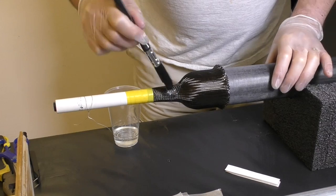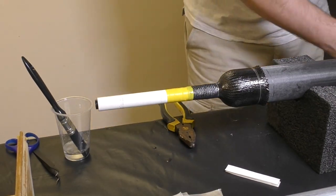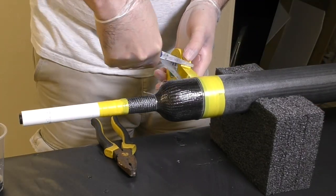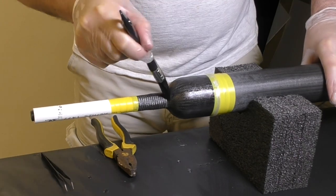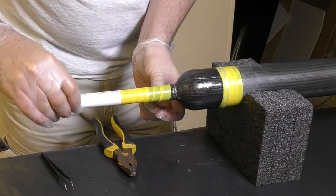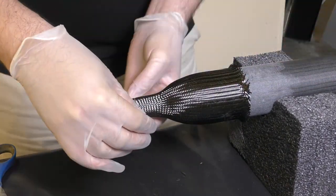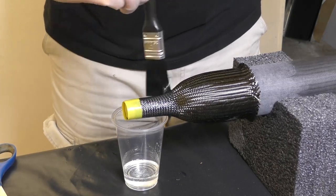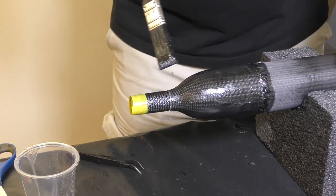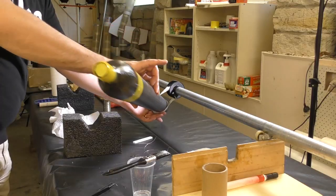We wet out the sleeve and stretch it over the end cap. The other end of the sleeve gets taped down with electrical tape, giving it a nice smooth transition to the body tube. We add some gauze of 85 GSM cloth to make the surface nice and smooth, and more electrical tape to compress the sleeve against the end cap. We do the same for the nozzle end cap — here the nozzle piece is left long enough so there's room to tape down the sleeve with no extension needed. Back on the rotisserie.